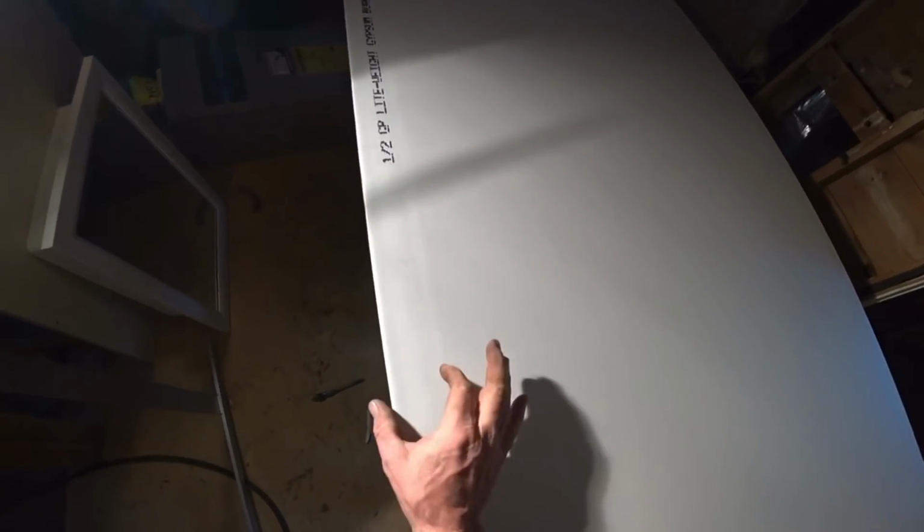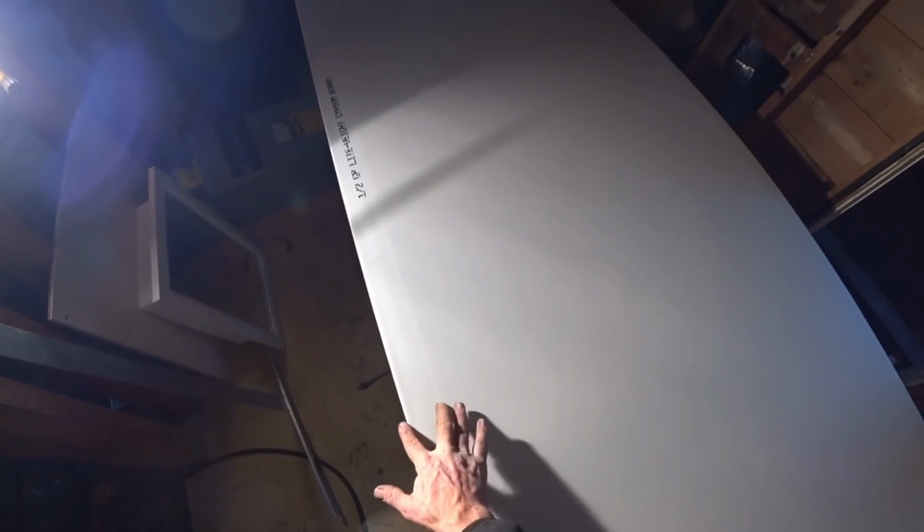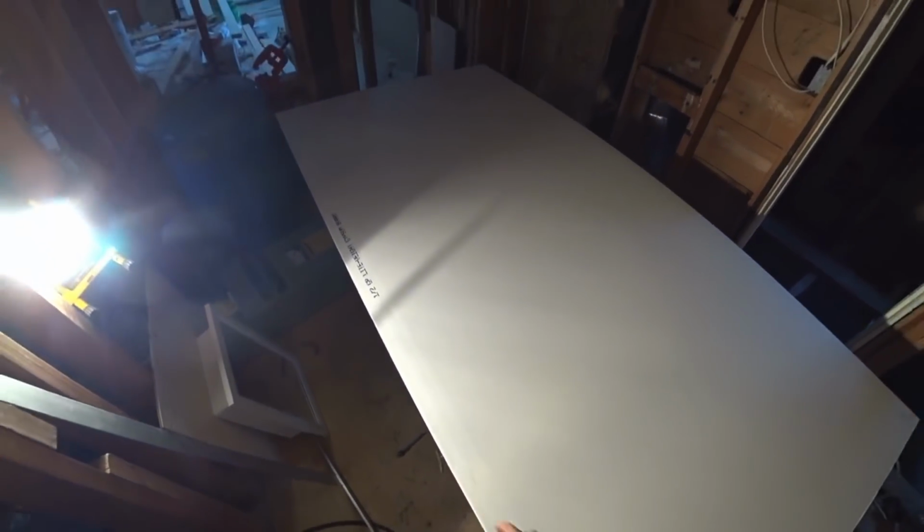But you can kind of see it. It's a rock material that is in between there, and it just has paper on both sides and everything. And the white side is the finished side. Now you can look at a sheet of drywall and you can see it kind of has like a taper here. You can kind of see like a shadow, like from right here. This is actually narrower on the edge from right here to here. That is your mud spot. That's where you put your joint compound.